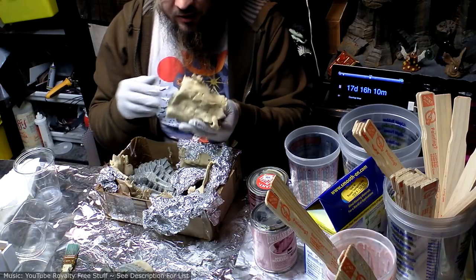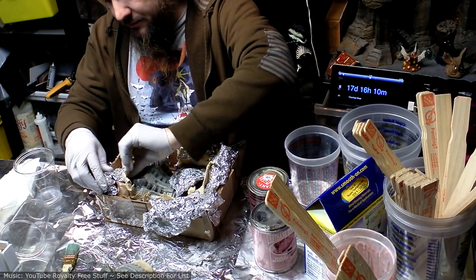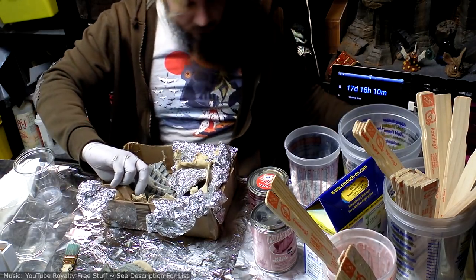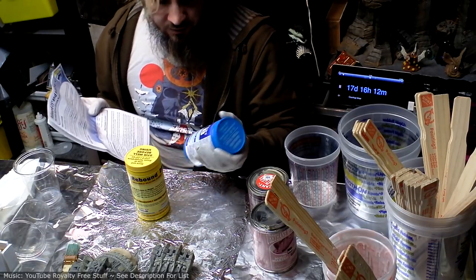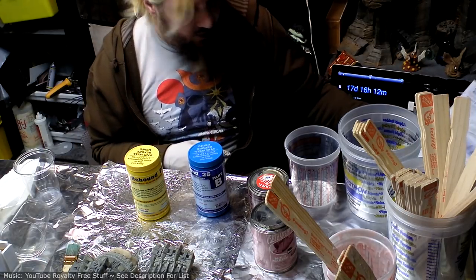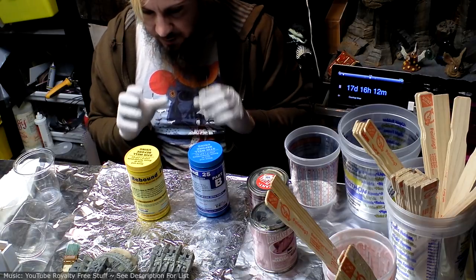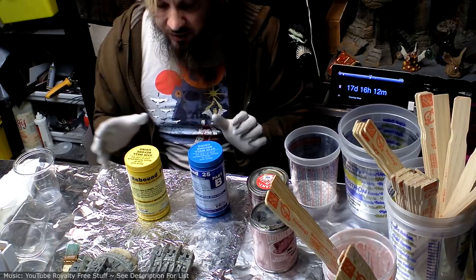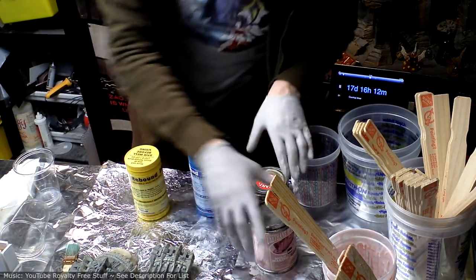The really nice thing about clean clay though is that you just throw it in a bucket and use it next time. So it says here the pot life of this Rebound 25 is 20 minutes. So I can't mix up a giant batch and then just glob on it forever. I need to mix up smaller batches, probably gonna shoot for 10 to 15 minutes or less to get it on there. So here we go.